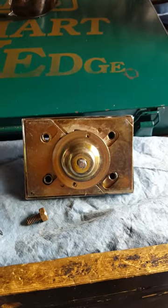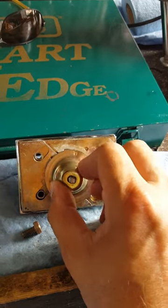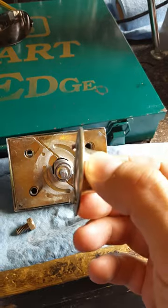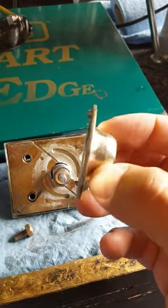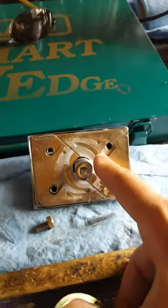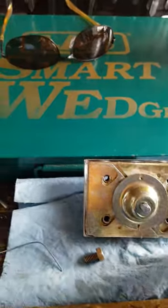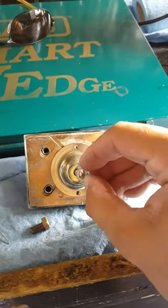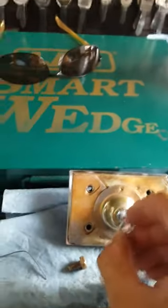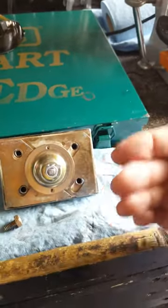Alright, so we've explained how this turns with the key. Those two little flanges stick out and have to fit into those grooves. Basically you got that piece on, then you got this little lock washer with little ears on it that should hold this nut in place and keep it from backing off. The whole thing is spring-loaded.